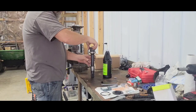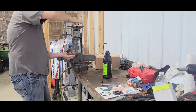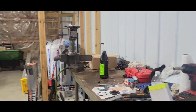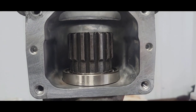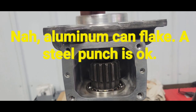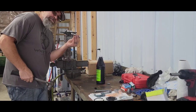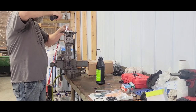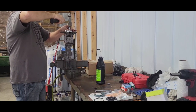I'm going to put it together and add a little lubrication in there. Let me show you what's going on — so that's where I got it. Now it's just a matter of knocking it down into that race. I'll put some aluminum on there and knock it down into place, then get that retaining ring on. By doing it this way with the punch on the inner race, that's what you want. It's going right down — very easy.